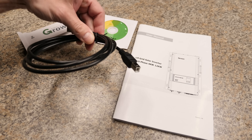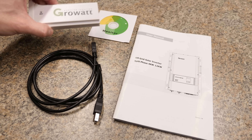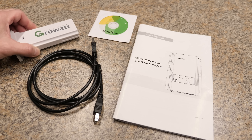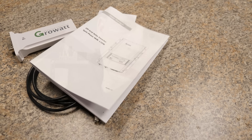It allows up to 150 volts DC input on the solar side and up to 120 amps. There are actually two different PV inputs: PV1 and PV2. It comes with a USB cable, monitoring software you load on your computer, a Wi-Fi dongle for remote monitoring and changing settings on the inverter, and of course a user manual. There are a bunch of other options but we're not going to get into all those features in this video — just a quick overview and then we'll open it up.